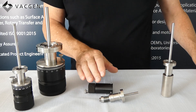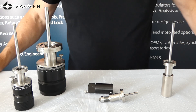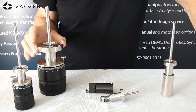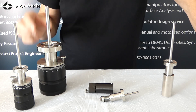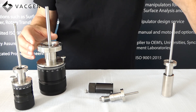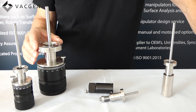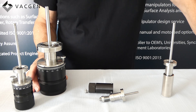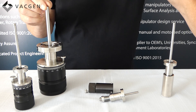Also the worst part of the bellows drive is if it leaks — if it leaks then you are going to have to change it. On the magnetic rotary drive, the reason this is much better is because there is an envelope inside that covers the whole of the magnet assembly. So there is no way that this can leak to atmosphere. You have got a set of magnets on the outside and a set of magnets on the core of the inside of the shaft.